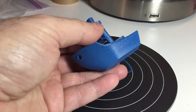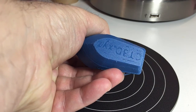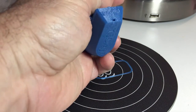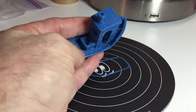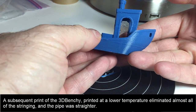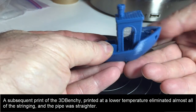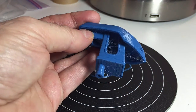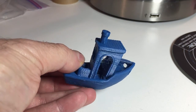This is the second print from the new Eris printer — a 3D Benchy printed in PLA. The bottom came out pretty well but there's some banding and a lot of stringing. That may be expected since we haven't tweaked any of the retraction settings, so there are lots of little hairy strings in there. The pipe is not quite as straight as it could be and you can see all the strings in the bow. But it's not bad. We'll clean it up and see what changes need to be made.